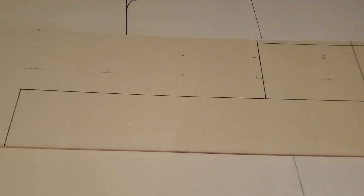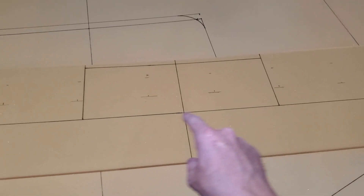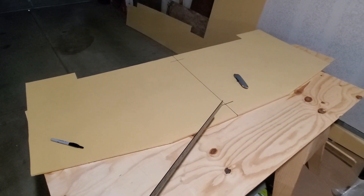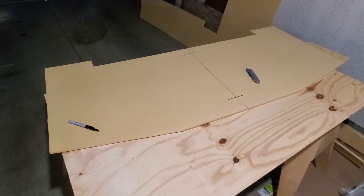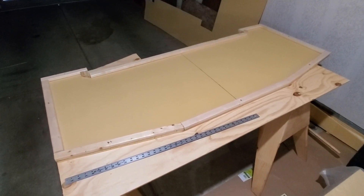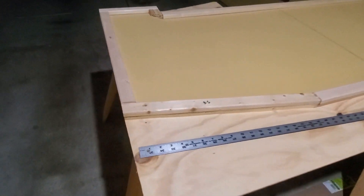For the little portion I cut out, that's going to be added to the top of the rest of C5 — I've added this little square, which is part of the doghouse. The reason I don't go the full 80 centimeters is because we have to curve this. The transom is now cut out and I've put a mark 10 centimeters from the bottom and 7 centimeters from the top — that's where I'll put in a more solid core to hold the brackets for the rudder. The inside of the transom is going to get a frame of 1x2s just to strengthen it up since it'll hold the stresses of the rudder. I'm not going to do this to all the frames.